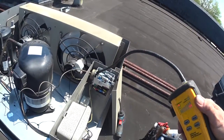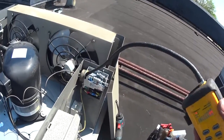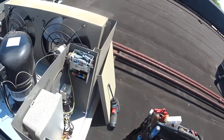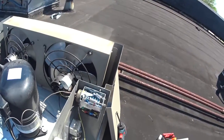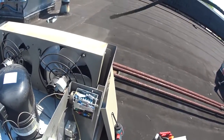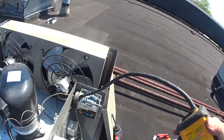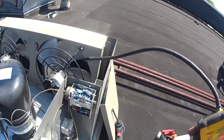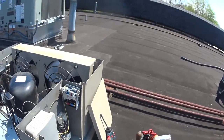What this is, is the leak is this bellows - it has a crack in it. It's constantly flexing on and off all the time, in and out, and the bellows developed a little crack. We're getting a leak right inside there, but that's where we're going to be changing - the pressure control.